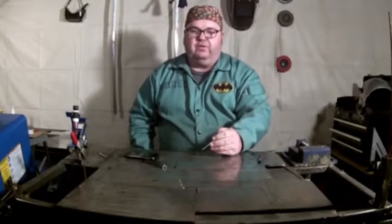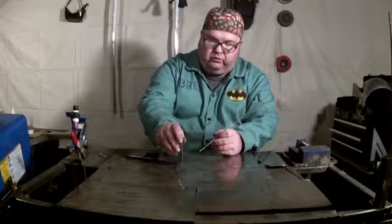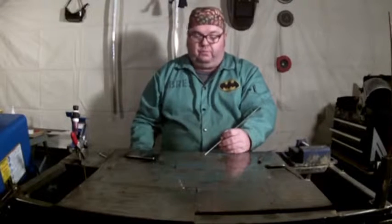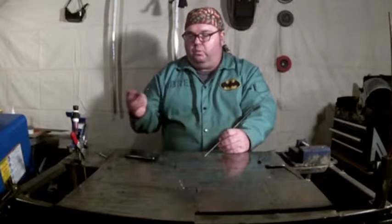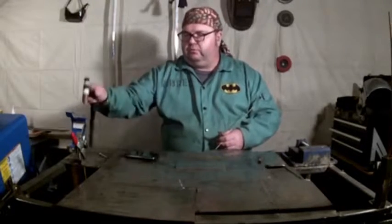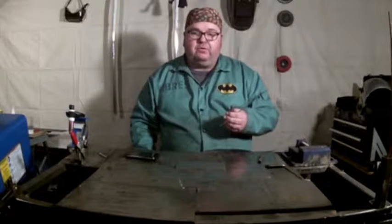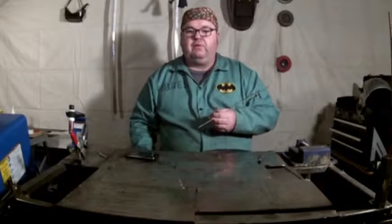We are going to create what's known in welding as an admixture. If I were just going to braze this on here, I'd simply get that steel cherry red and melt the silicon bronze into it. And frankly, that would be strong enough for this purpose. But I'm actually going to draw a puddle with Hazel, my CK Worldwide number 17 flex head torch, and we're going to add the silicon bronze to the molten steel, creating what's called an admixture. And that is how we're going to do it. Just for something a little more fun, make it a little more interesting today.